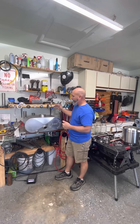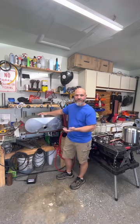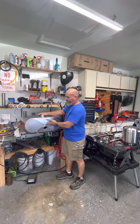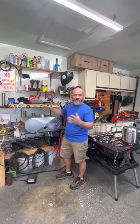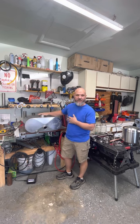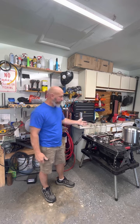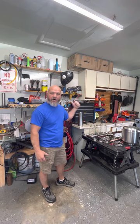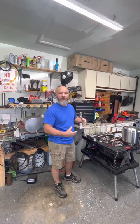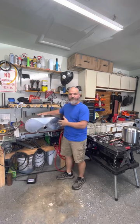A little bit about the tank: it's made out of 16-gauge stainless steel. It's got a cross break across the top and a cross break across the front and sides, just to keep it stable and keep the stainless rigid when you put your fittings together. You can see we have a variety of different stainless fittings that you can use on this. The jars are something I make that would be considered an upgrade from your base tank.